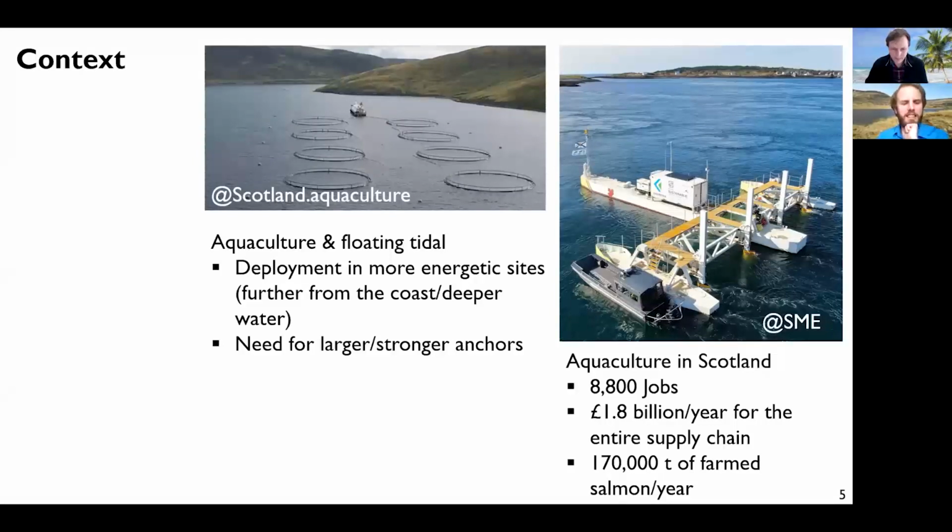The interfaces, as Benjamin indicated as well, were Mohr-Coulomb, so with a friction angle and zero cohesion, I guess. For purely frictional interfaces, you could have applied the Hoek-Brown model as well. An interface in Optum is basically a very thin layer of material, with the same material properties as the surrounding soil. So you can apply any model to the interfaces, and Mohr-Coulomb is, of course, when we talk frictional interfaces, an obvious one to go with.